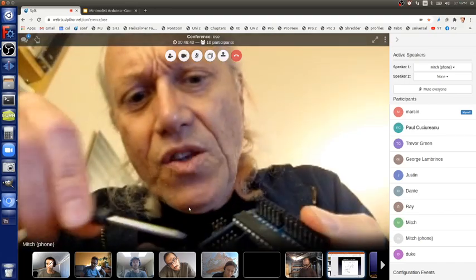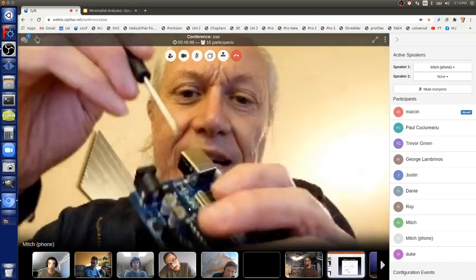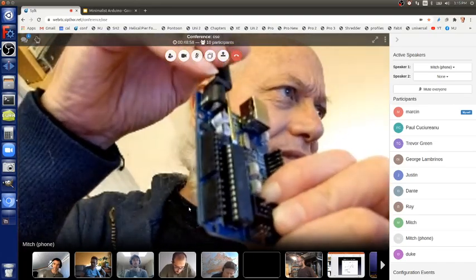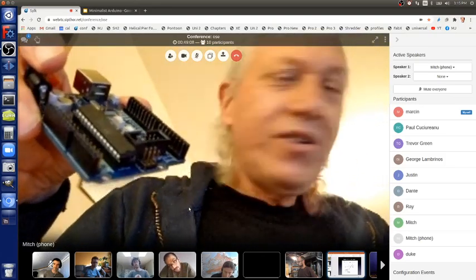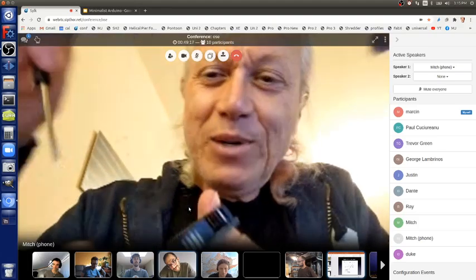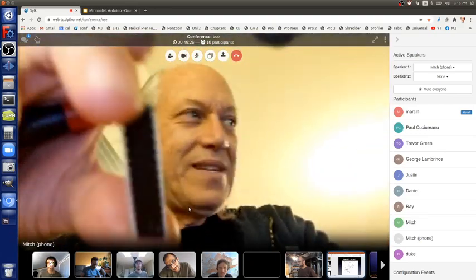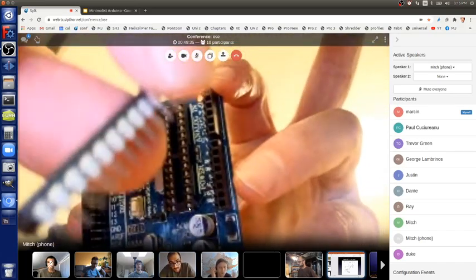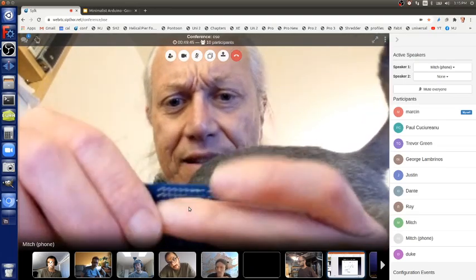And you can take your screwdriver here, you've got to be careful. Put that in here and just kind of wiggle a little. And then I'll do the other side and wiggle a little. Then you go back and forth. And if a cat is not on your keyboard, then you get to see what you're doing. And then you can pop the chip out. Cat willing. And then here's the chip that's no longer in the Arduino board. You can see the Arduino board without the chip. That's a socket. And then you can put the new one, or your minimal Arduino one, in there in the correct orientation. And now it's ready to be programmed.